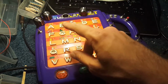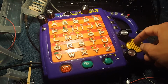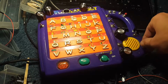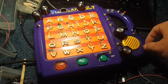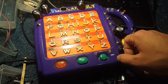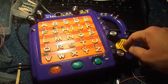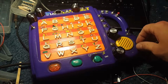When you're starving it of a good ground and you're starving it of voltage and doing all that stuff, the motherboard trying to push voltage through the speaker with op amps and amplifiers and other stuff, it just really drags down and it sounds great. If this speaker was off because you had the line out running, which is common in a lot of consumer electronics, then that effect, you could call it, kind of goes away. So this switch right here actually turns the speaker on and off.